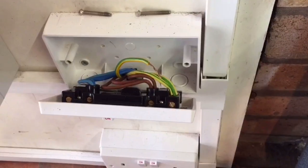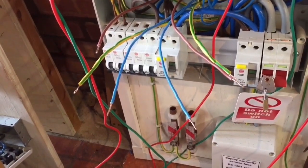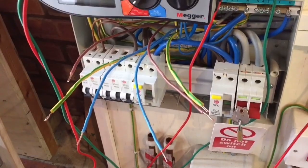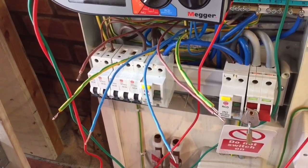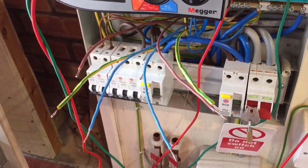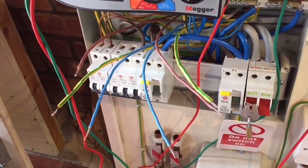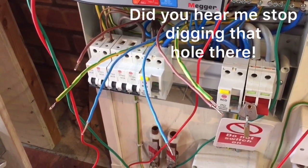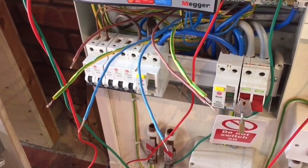What if you've got open circuit on all three — line, neutral, and CPC? What does that suggest? Well, it's going to be a missed-out socket. You might have completed the first fix, come back weeks later to do your second fix, and simply forgotten there's a socket you haven't put on — possibly obscured or plastered over. The other thing could be a cable that's been cut through — unlikely to be you, but when you're working with other trades it's possible. So: a cable cut through or a socket completely missed off.